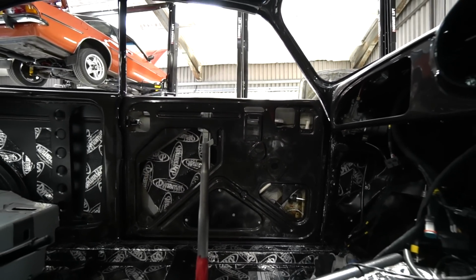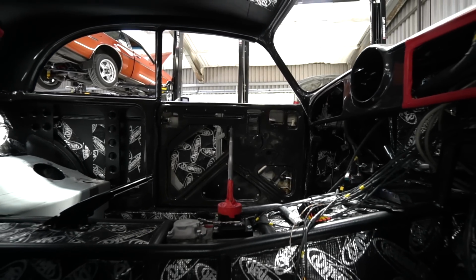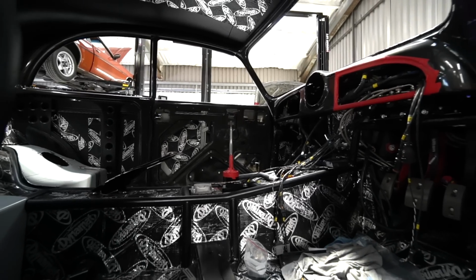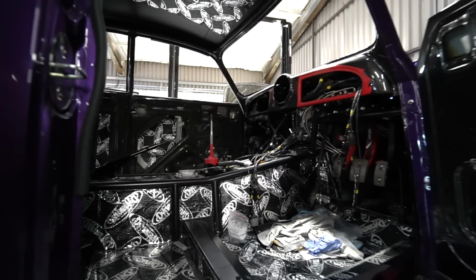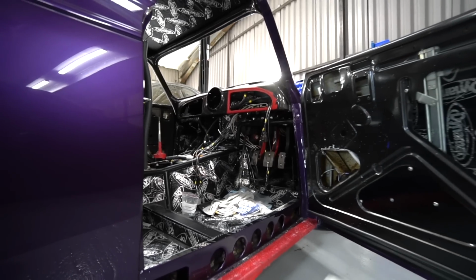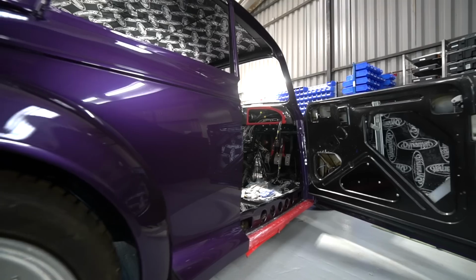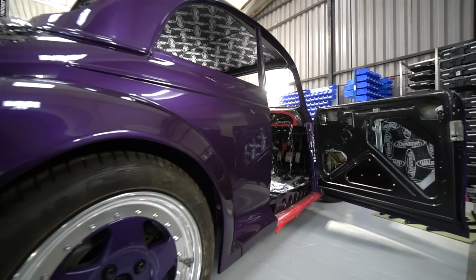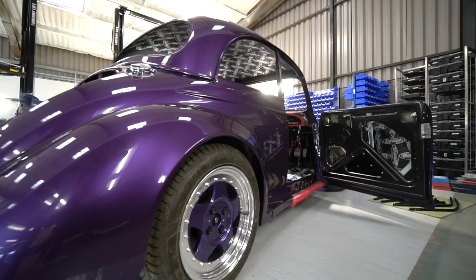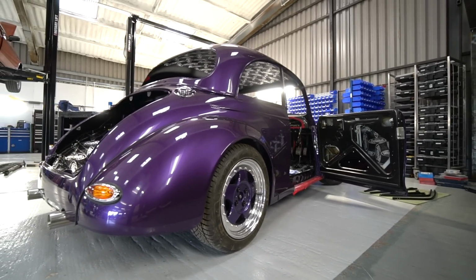So that's what we're going to do, is basically 2 thinner than normal layers, 1.5mm thick, to make the 3mm thick card, and the holes will only be through 1 layer. We'll put the pins in, the clips in from the inside, get the positions of all of those set, trial fit it, make sure we're happy with everything, and then glue another layer over the top of a solid material, either plastic or metal, so that it's completely solid, a completely plain panel on the inside, so there's no hint of them whatsoever. So we'll see if that works out, but hopefully it will.